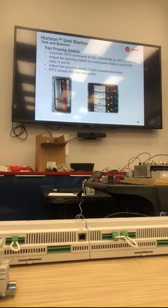With clean filters, yeah, things of that nature. And even then, sometimes we may not be doing it with the filters installed. Well, you get out to a site that's been under construction, you open the door, you look at the filters, you go, oh, man. So we're asking for this because we've had a lot of nuisance trips with getting fan failures. So this will prevent that in the future, and having return calls.